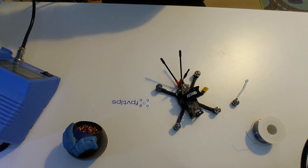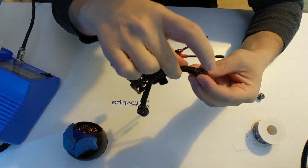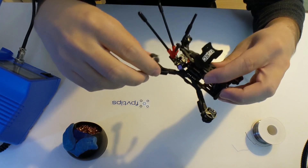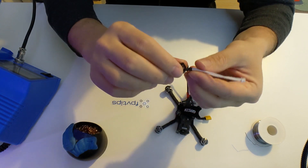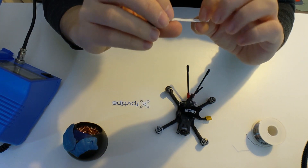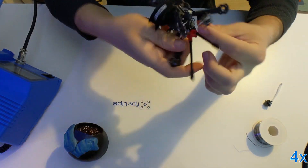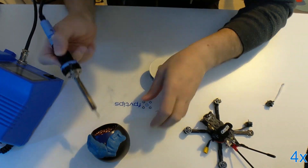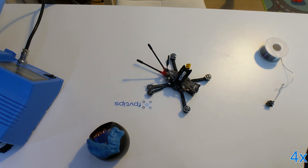When working with micros, in most cases the motors will come with a plug — if your flight controller or ESC board has the same plug, just plug those in and that's all. In other cases you might have to do some light soldering, but usually it's not a big effort. In my case the spare motor did come with a plug, but as the motors were already directly soldered to the board on the GEPRC Phantom, I had to remove the connector from the motor and prep the wires for soldering by stripping the silicone insulation just a bit and then pre-tinning the ends with some solder. We then want to take off the bad motor — just unscrew the mounting screws underneath the motor and desolder the motor wires from the ESC to finally remove the offending motor.